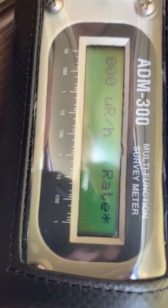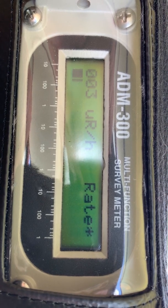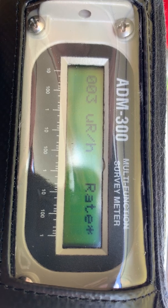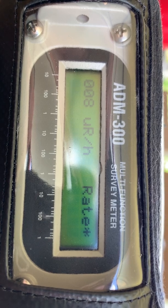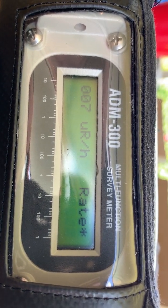The asterisk you see on the side of 'rate' means that the audio clicking is off, but the alarm audio is on. The moment you press the audio button, it disables that, and when you press it back on, it turns on the clicking and alarm. You cannot get the silent mode on as you power it off and turn it back on without touching the audio.